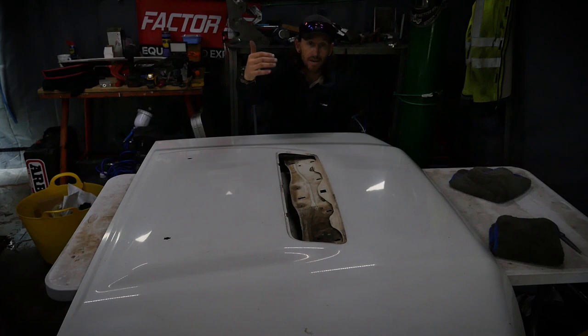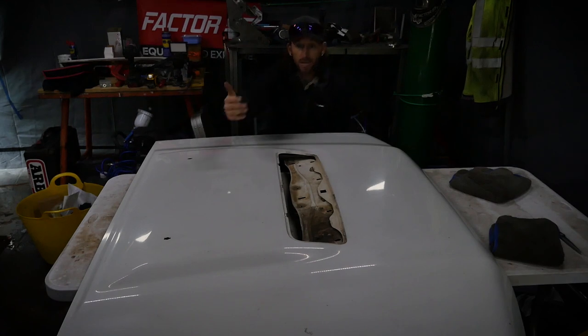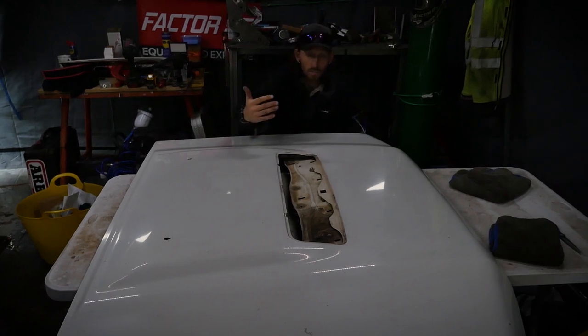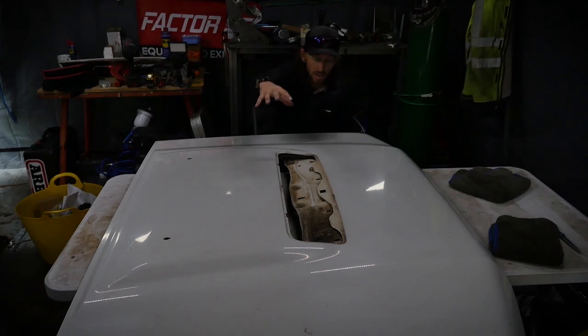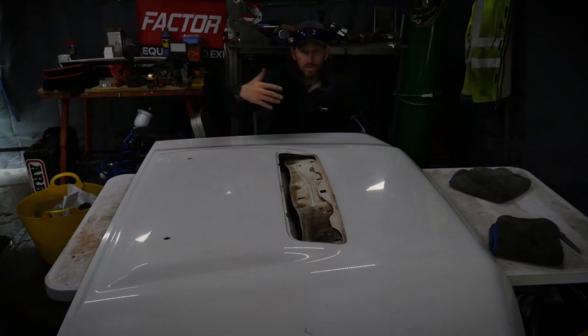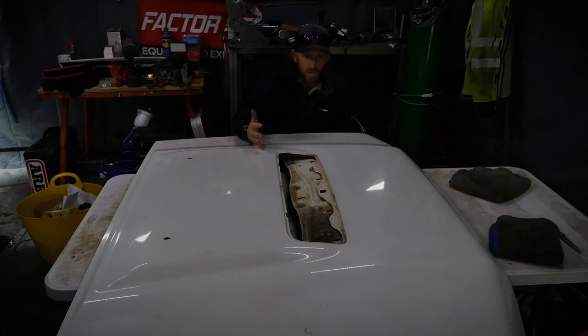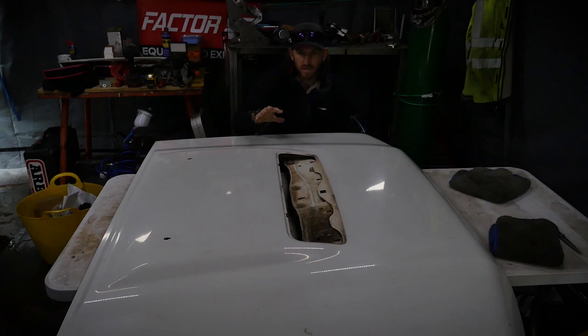Unfortunately, we are not going to have a top mounted intercooler. I have heard the front mount intercoolers are much more efficient. Yeah, they don't suffer from heat soak like the top mount intercooler. So we're going to leave that open for the engine, and then eventually over time we'll go to a front mounted intercooler, which will be much better, and this will really give the 80 series a nice unique look. That's kind of what I'm aiming for.